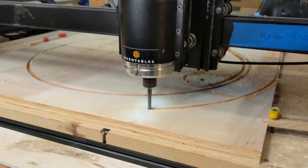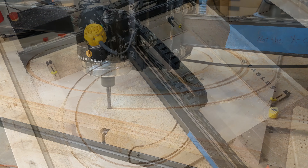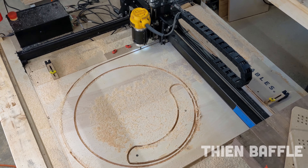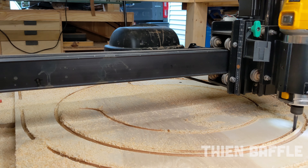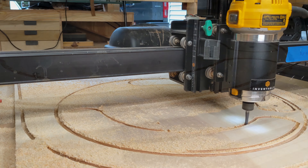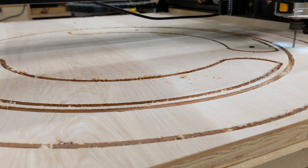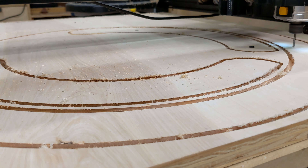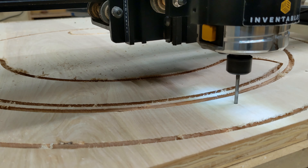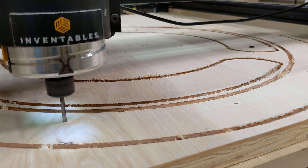To speak in more specifics, I've designed a collecting system based off of a Thien baffle in order to save on some vertical space over a cyclone separator. It would also be much more challenging to make a cyclone separator with my current toolset. I also planned the overall frame to save on horizontal space as best as I could, trying to stay within a two-foot square — though I might have abandoned that a bit with one of the components we'll see later.